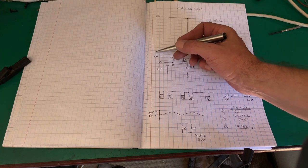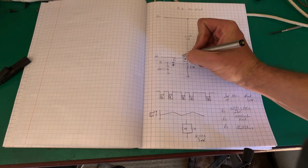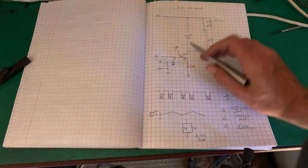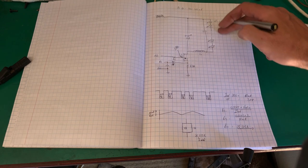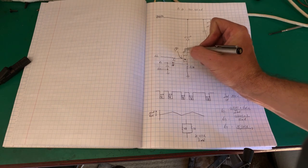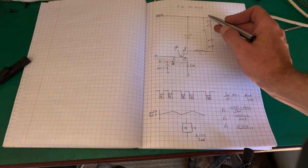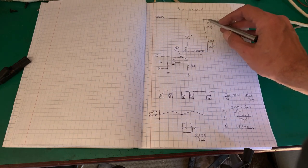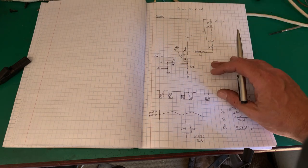This is going to an IC on the bottom side of the board, but if you remember correctly, at that point there we measured 5 volt DC. We measured 220 volt DC up there, but here we measured 0 volt DC, and we can see that because as we've been testing the diodes, some of them lit up, some of them were dead short, and some of them were just open. So even if this is switched on, because that's open, the circuit is broken.